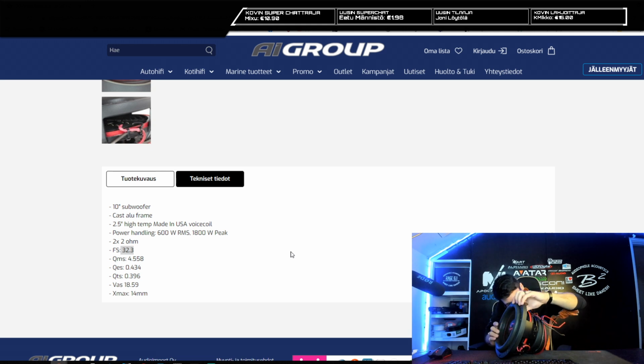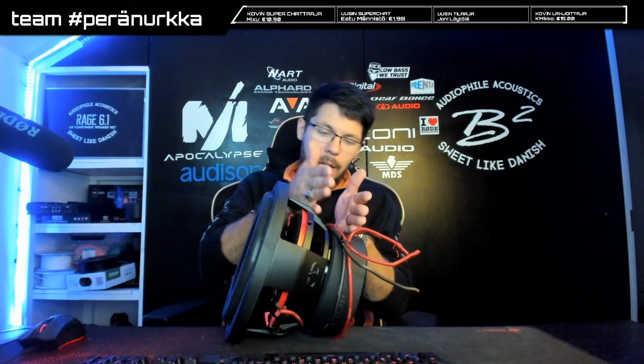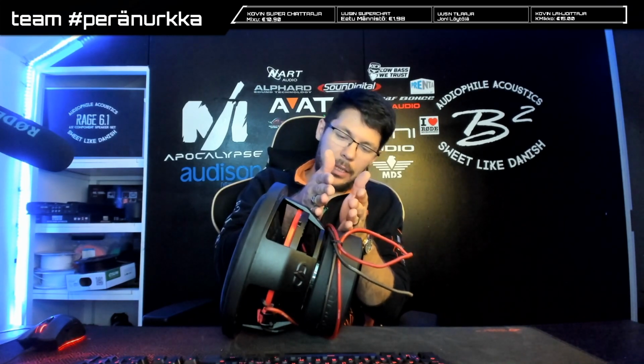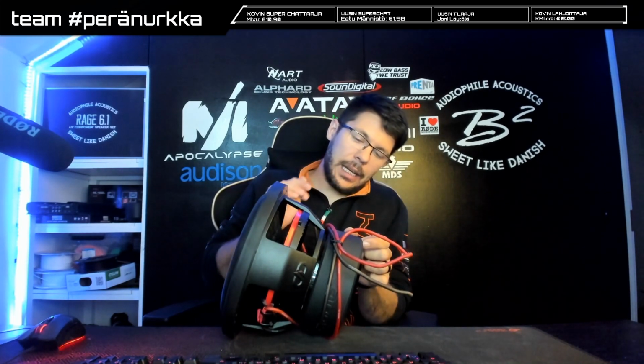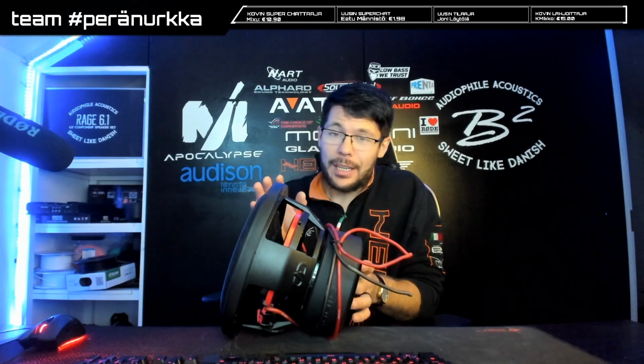Actually, if I can just check it here, it is a really long voice coil. To keep in mind, we have the top plate like in here and it starts from around here, so we have a voice coil around 60 millimeters. If I go back into the face cam here, we have probably 50 to 60 millimeters of voice coil. So there is not that much room for the voice coil to behave in the magnetic range, and if it goes over or under it, it will just demolish itself.